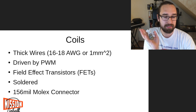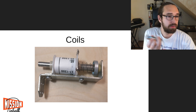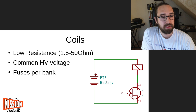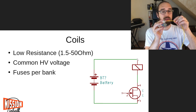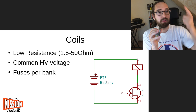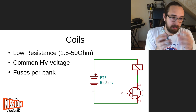But if you finish your machine, in my opinion you should add diodes everywhere. If you do a production machine, just do it. So this is the coil - here we have two lugs where you solder your wires. The circuit is relatively simple: you have a 48V power supply, your coil, and a field effect transistor that connects the coil to ground. You share high voltage from your power supply and connect it to one side of the coil, then daisy-chain a second wire from this coil to the next coil, and so on. There's an individual wire from each coil to your driver board, which connects the coil to ground when it should be active.